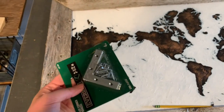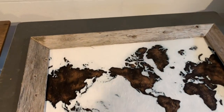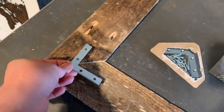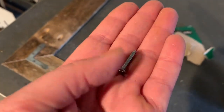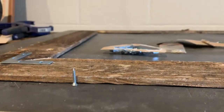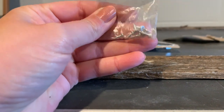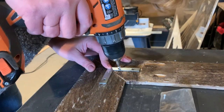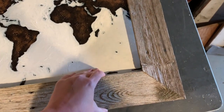I think I'm gonna put the frame together first, and then I'll be able to properly center it, glue it down, clamp it, and then put some more reinforcement screws on the back through the board to the wood. These are two-and-a-half-inch flat corner braces and I'm going to put them on all of the corners to keep this together. The screws that come with them are way too long — if I screwed through this fence post they would stick out the other side and hurt you and not look good — so you're going to need some little itty-bitty baby screws used for picture hanging and hardware.